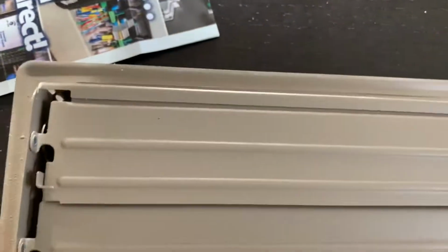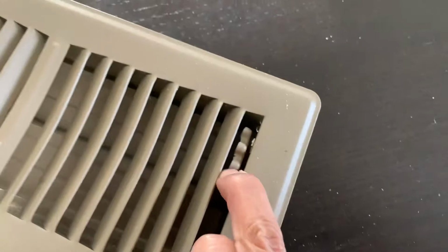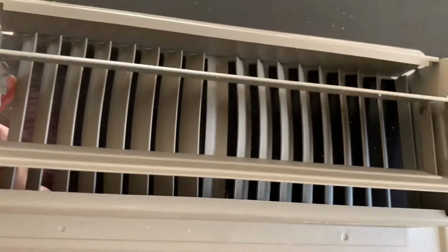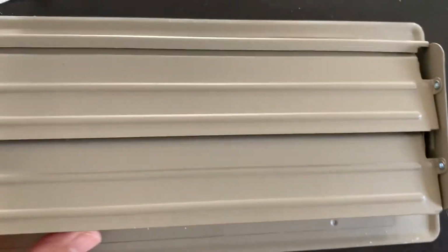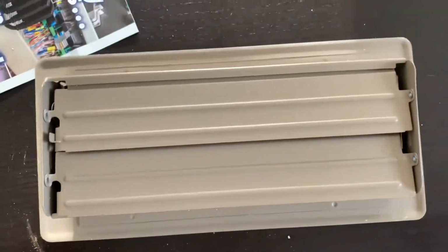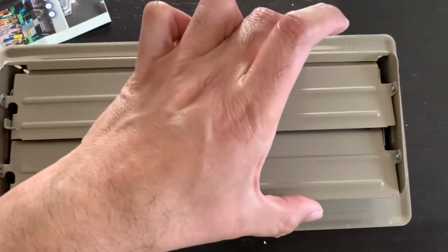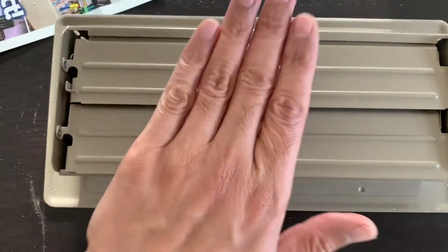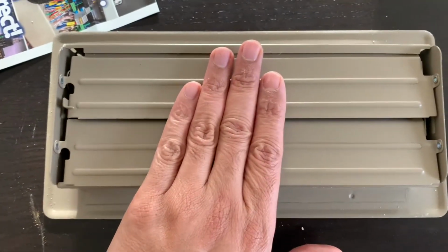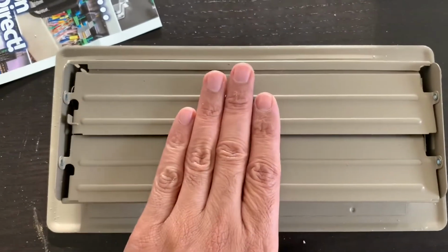from this screw, this is how it works. So if you want to reduce the airflow, just paste some hard paper on it, because if it is a soft paper, it will constantly be fluttering whenever the HVAC system air handler is coming on or off.